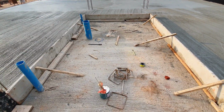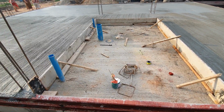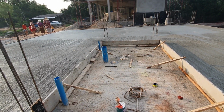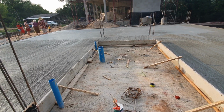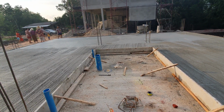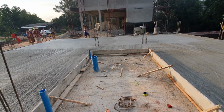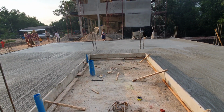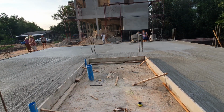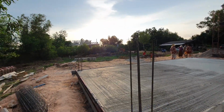This little recessed area here, the lower, they poured that yesterday. That's the bathroom. They put the lower floor in, then they put about 2 or 3 inches of another layer of concrete, and then they put a slurry of an inch or two of mortar, and then they lay the tiles on that. They don't stick the tiles to the base, they put a big 2 or 3 inches of mortar in, and then lay the tiles on top of that one at a time, and tap them into place with a rubber mallet, and they're like a mirror, and they've got about a cigarette paper of grout between it. Beautiful, beautiful job. People coming from all directions, the kids are playing in the dust. I love it, I love it.